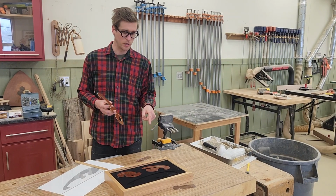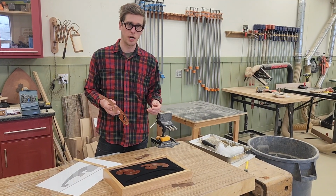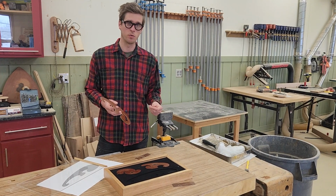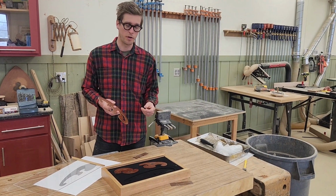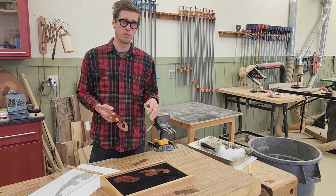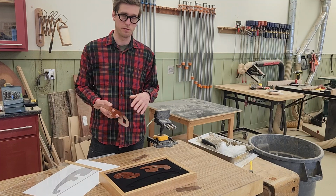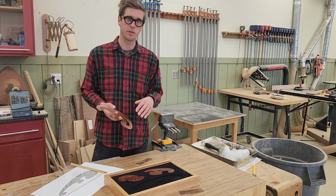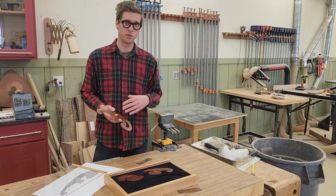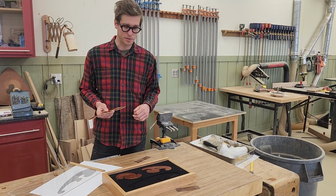The other thing too, the Baltic birch tends to be pretty porous and really dry, so I think some of the adhesive soaked into the wood too, which didn't really help in my favor. So to maybe even alleviate that, other than applying a liberal amount of the adhesive, Mark had actually mentioned putting a finish on there, so you have a really nice smooth surface that's non-absorbent, and so again, you may not have to put as much adhesive on there. Just a word to the wise.